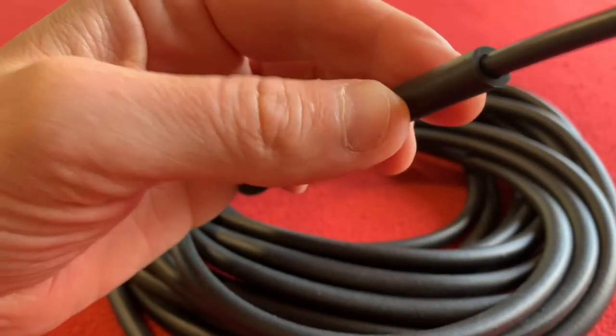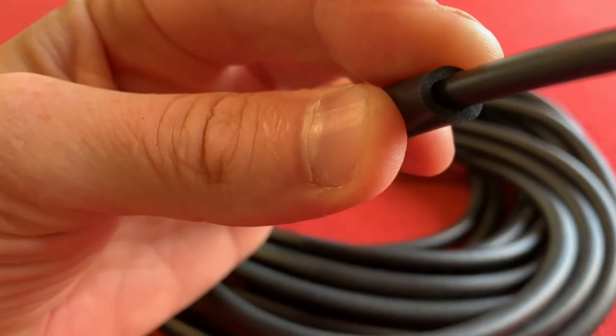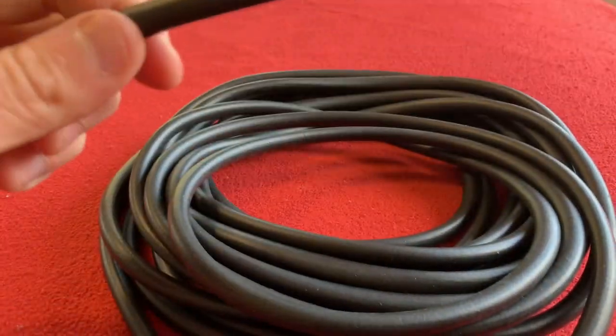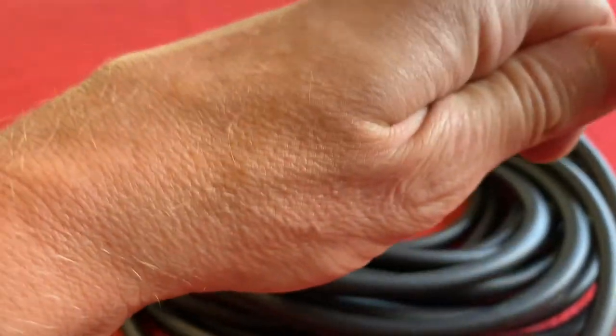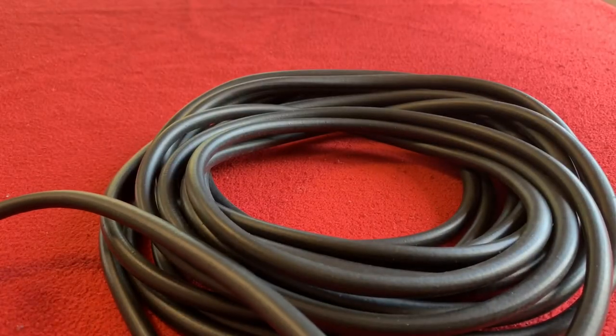It's not overly tight — as you can see there's a little bit of a gap — but it is reasonably tight, and to push through this 1.7 metre length of hydraulic hose, see I've got it to there, it's going to prove interesting. I reckon with some talcum powder or maybe some graphite powder, that would go in a lot better.